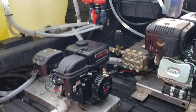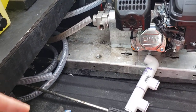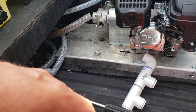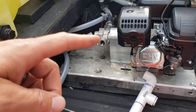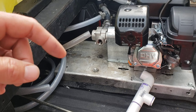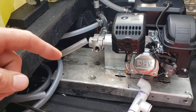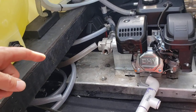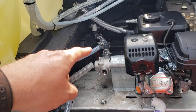The cement is curing on the second manifold. I think what happened was just the PVC being directly connected there. I had a pressure gauge and a bypass on this little manifold that I made, and I just don't think that schedule 40 PVC was up to the task. So what I'm going to be doing is coming out of the pump with schedule 80 to one inch non-collapsible, and then I'm going to have my new manifold set up with the pressure gauge and the pressure relief valve. Underneath my setup here is 10 feet of three quarter inch line coiled up, sent back to the pump inlet right there.